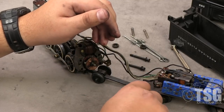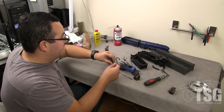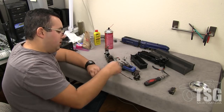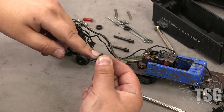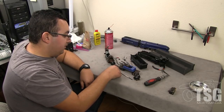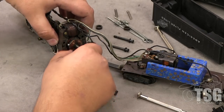These are our carbon brushes — these ones are not in bad shape lengthwise, but they could use a little cleaning. How long should they be? These brushes are only about a year old, so they don't wear down too quickly. With the magical contact cleaner, just give a little shot on the end of the brush. If you go in there and they're really short — you can see this brush has a shoulder on it — if they're down to that shoulder or a little before, you'll want to change them. When you change the brushes, also change the brush springs — they're usually sold together. You can find them through vendors that specialize in post-war American Flyer, or just search 'American Flyer brushes.'